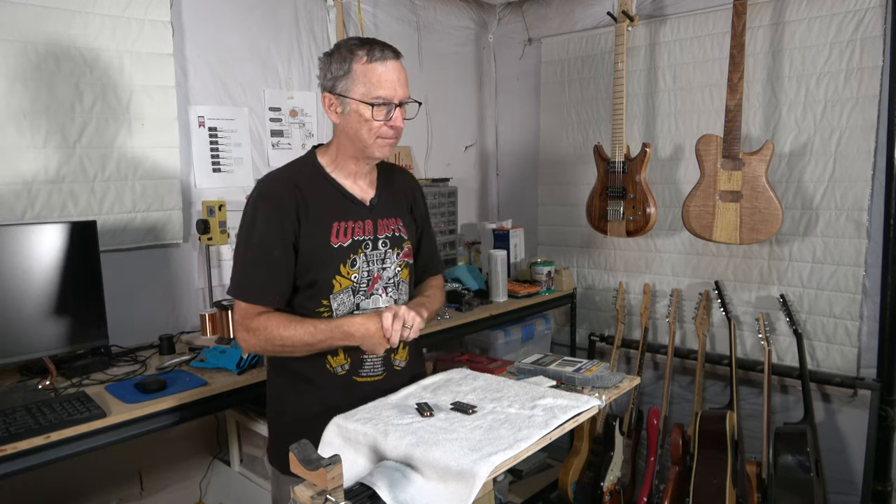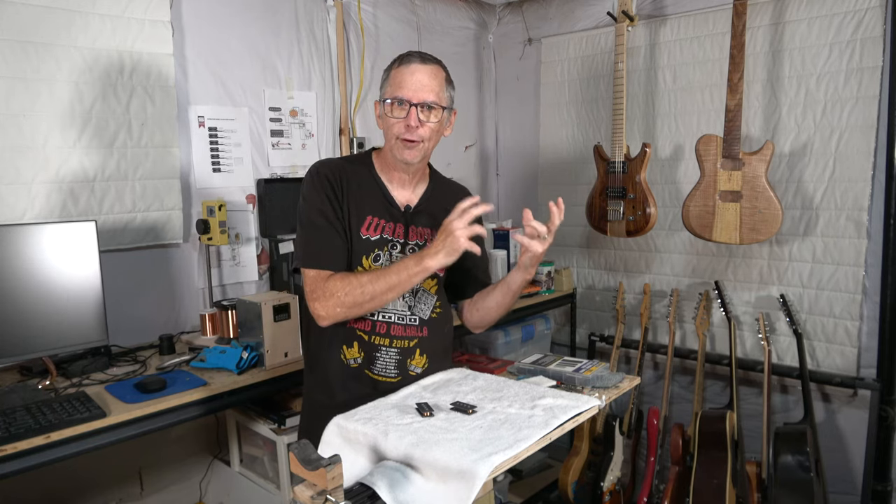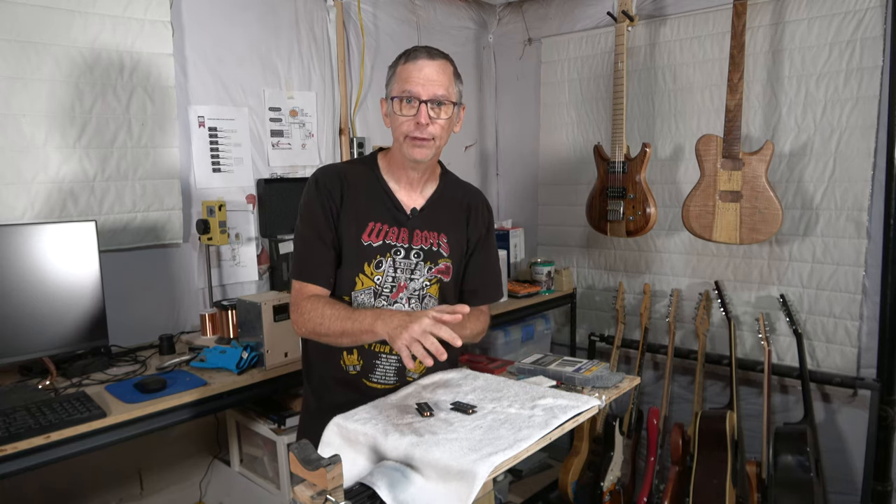What I'm going to talk about today is part two of my electric violin project. I'm hoping to cover the basics of how I go from the design process through to writing the G-code that I'll need to carve out the different parts of the instrument on my CNC machine. I'm not going to get into excruciating detail — just an overview. I'm using a CAD/CAM process: Rhinoceros 7 for CAD, and MeshCAM for CAM — two separate programs that work together to create the G-code files for carving the body, neck, and fingerboard.